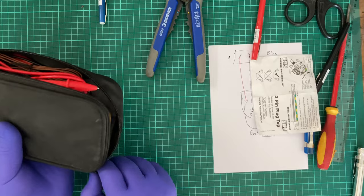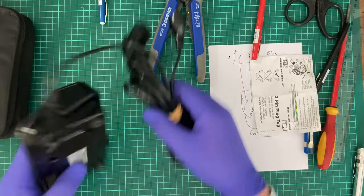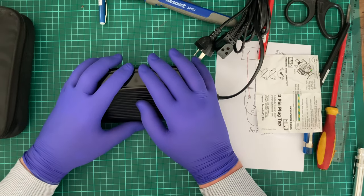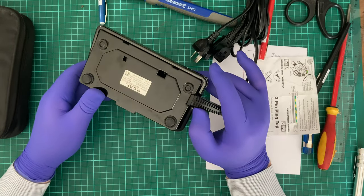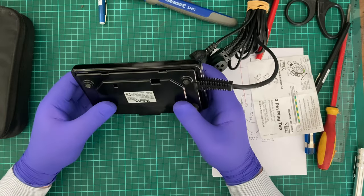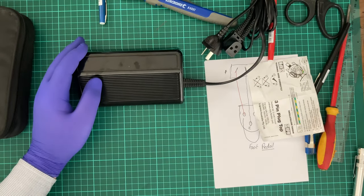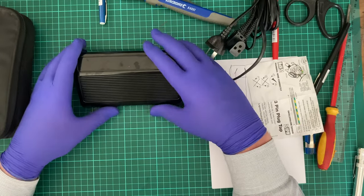As for the original problem, what I learned about sewing machine feet is like this one here. The YouTube link I linked in my other video showed that there was a ceramic, and I believe said carbon resistor, which would be something similar in this model. And that would give you the... actually, how on earth would you open this? That would give you the speed control. Whereas the other one, it appears to use a MOSFET type device. And that would provide the proper voltage to the motor for the speed control.